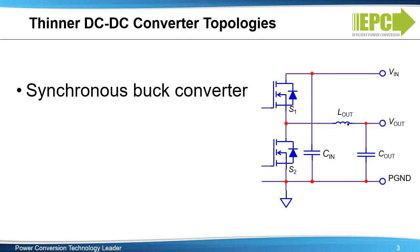The bottleneck of thinning a DC to DC step-down converter lies in the magnetic components. Designers usually have to either embed them into the circuit board or increase the switching frequency to shrink their size. The former increases design and assembly complexity, while the latter requires advanced switching techniques to maintain high efficiency. Otherwise, it incurs lower efficiency as well as thermal problems. In general, inductor loss also increases when it gets thinner. These are the issues that confront an ultra-thin synchronous buck converter.